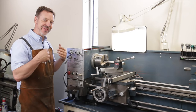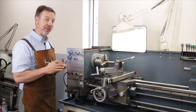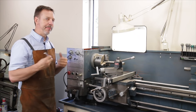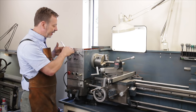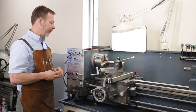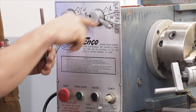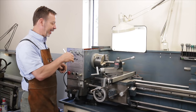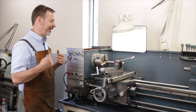The bearings check out great. Now it's time to look at the transmission that drives the head and changes the speed. This one is a gear head. The advantage to a gear head is they're usually quieter, easier to change, and have better power transfer from the motor. Belts can be very inefficient. This one has six gear changes for a total of nine different speeds, and stepping over on the motor gives another nine — a total of 18 speeds. The speed ratios aren't perfectly spaced — you can jump from 90 to 240, then 240 to 260 — but it still works quite well.